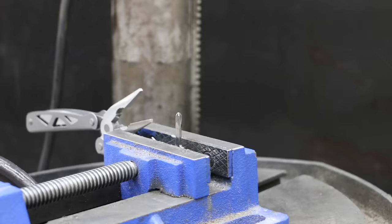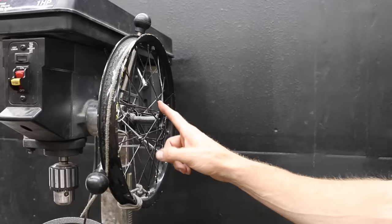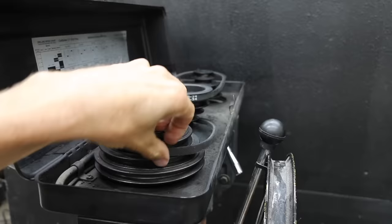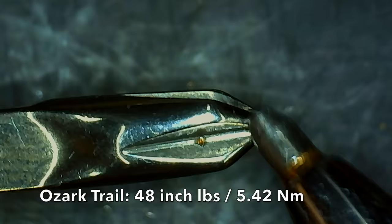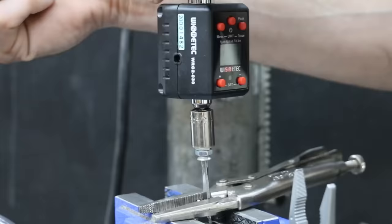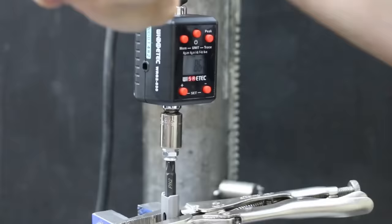Let's test the strength of the Phillips screwdriver next. I'll place the Phillips screwdriver and a fastener into a socket. A torque adapter will keep track of the maximum torque, and I'll use the drill press with a 10-pound weight to apply about 70 pounds of downward force. The Ozark Trail performed fairly well at 48 inch-pounds before it cammed out, with a very small amount of visible wear. The Hart did quite a bit better at 59 inch-pounds before the screw broke, no visible damage. The RoverTAC made a popping sound and cammed out at 45 inch-pounds, and unfortunately the Phillips screwdriver was ruined. The Stanley cammed out at 51 inch-pounds in second place behind the Hart, but the screwdriver bit experienced quite a bit of damage. The Mossy Oak easily outlasted the screw, which broke at 95 inch-pounds with no visible damage to the bit.